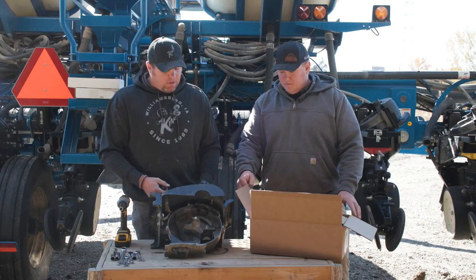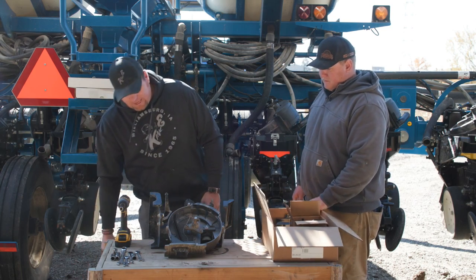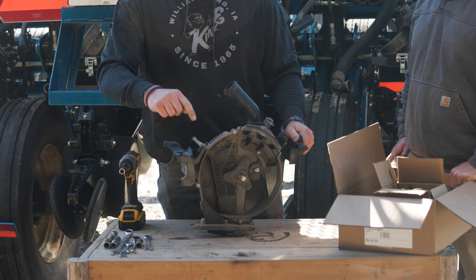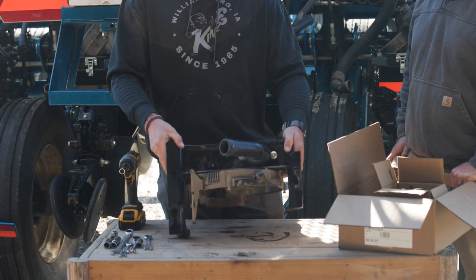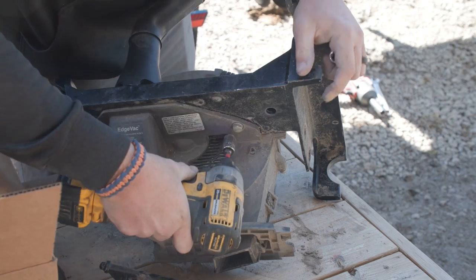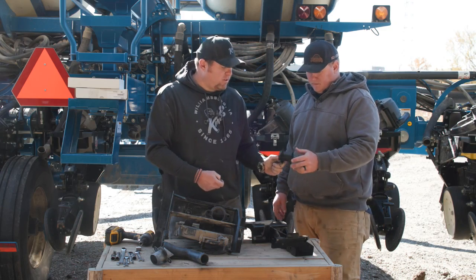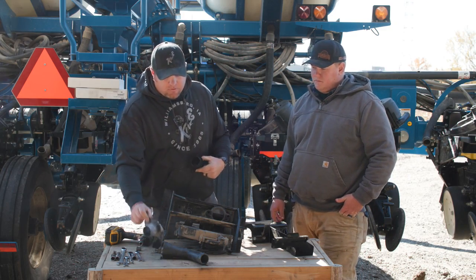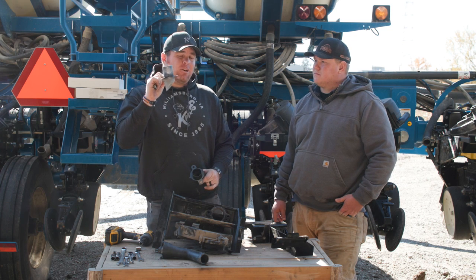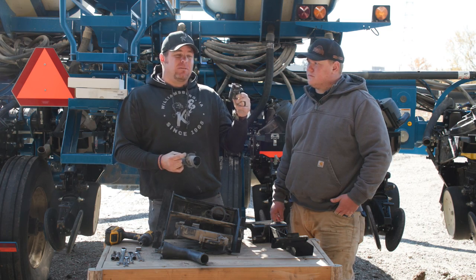To see better we're going to take off the meter cover and set it to the side. Really the only thing we need to save from the old meter is the bracket that holds the meter cover. We'll take the elbow from our bulk fill hose off and put it on the new housing. For the new diffuser — if you look at the old one versus the new one — the old one had an angled baffle piece to help limit the seed pool in the meter. You don't need that in the true rate meter because the baffle is built into the meter itself.